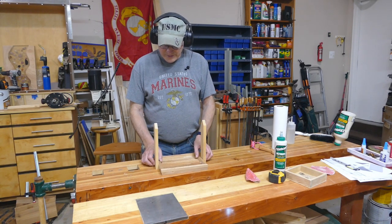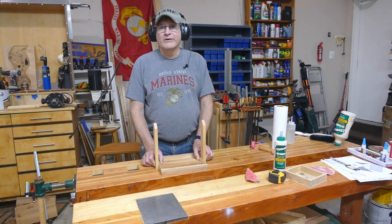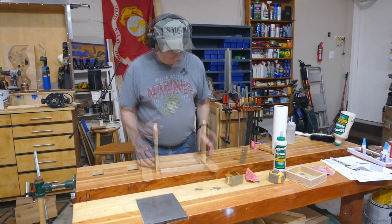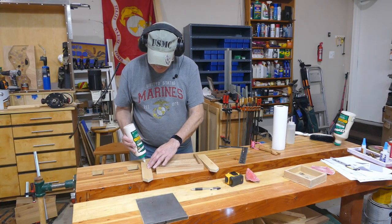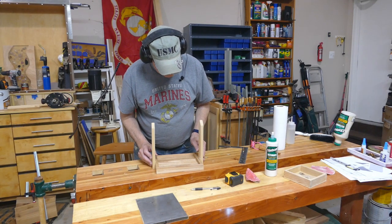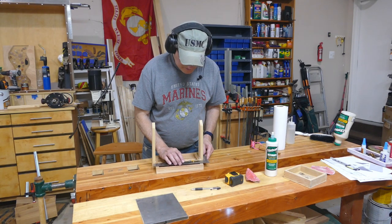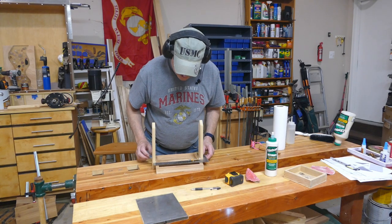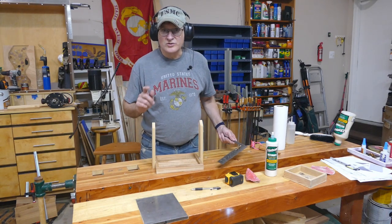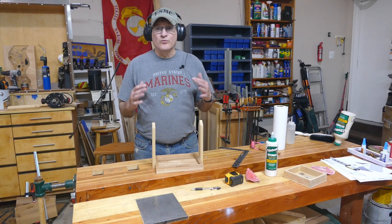Can't really do too much harm. Or you can just glue it together — put some glue on it, put a couple clamps here, call it good. You will need to secure the roof a little bit more, but we'll get to that in a second. Let's put some glue on this and nail it together, just to check it and make sure they're in the same spot. All I'm doing is putting the square on one side and making sure it touches here and touches on both of these so that way they're even. Even if it's shifted a little bit either way, that's fine — they just really need to be even so that the roof fits perfectly.